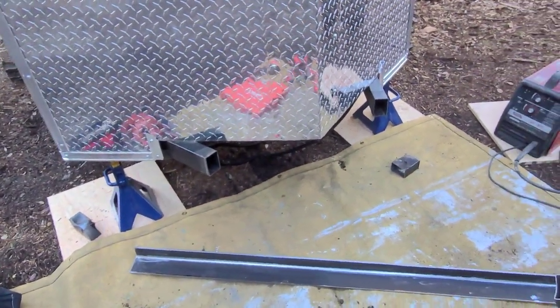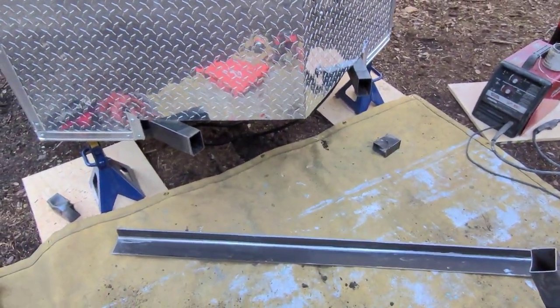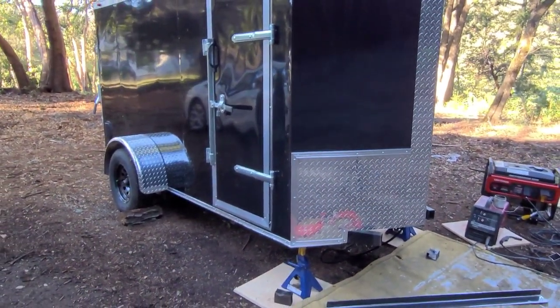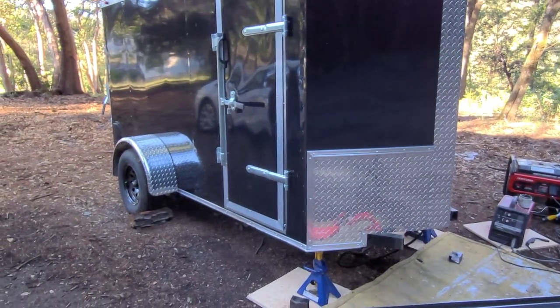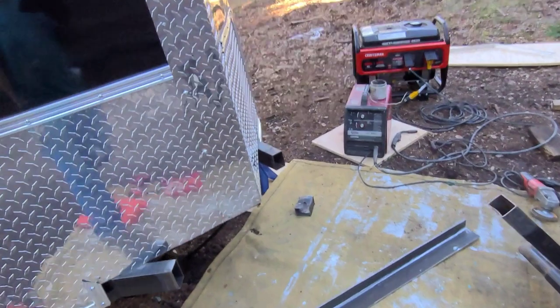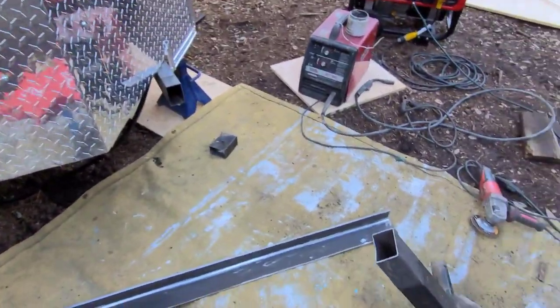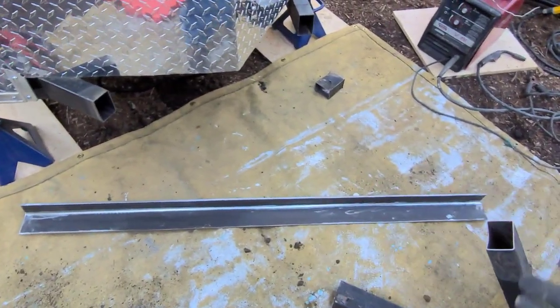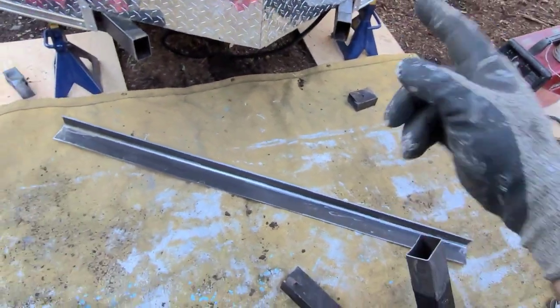So the thing that I wanted to tell you guys, if you buy a trailer, I mean, it's not that big of a trailer. Here is the full trailer. There's probably 1,000 pounds evenly distributed through the weight. But the customer wanted to put a load dispersing tongue on here to get the weight off the truck. It's like a sway control and the load distribution. And that's what made the frame buckle.